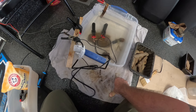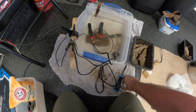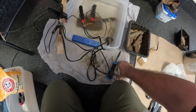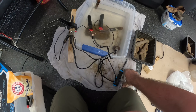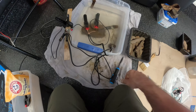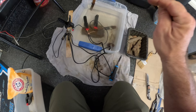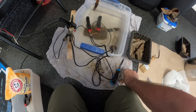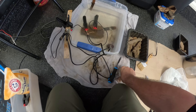It's buzzing, it's turned on - I've got it on 12 volts, six amps. I can see the water starting to kind of move a little bit. What you'll see is it'll start bubbling. I'm gonna leave this thing alone - if I come back in an hour, this thing's gonna have bubbles coming up and crud on the top. As a reminder, don't touch the water or you're gonna get yourself zapped. Everything is energized right now so just be careful.